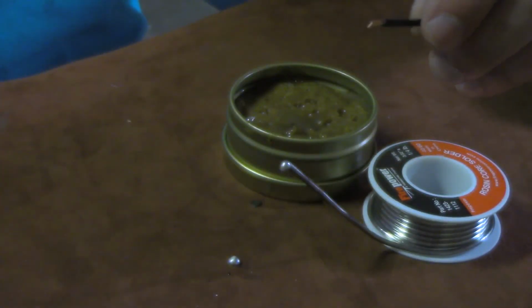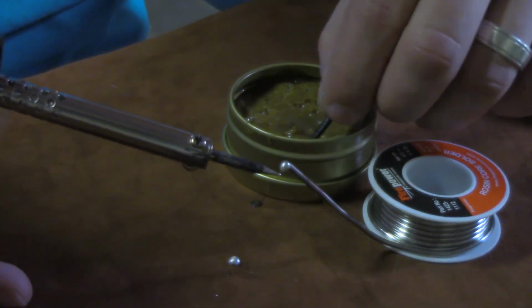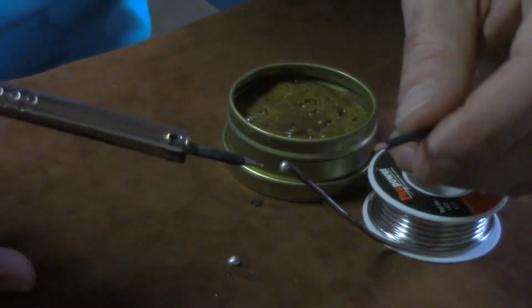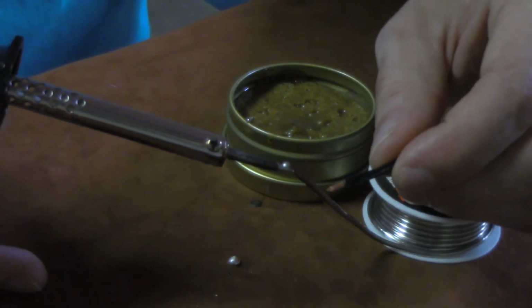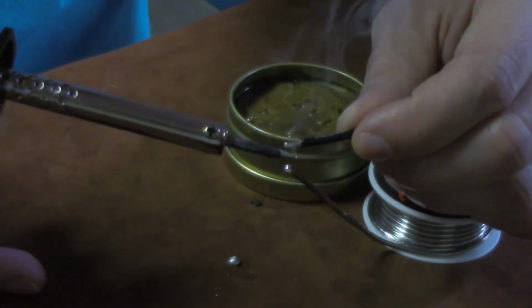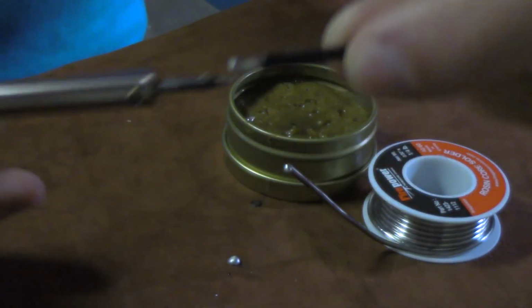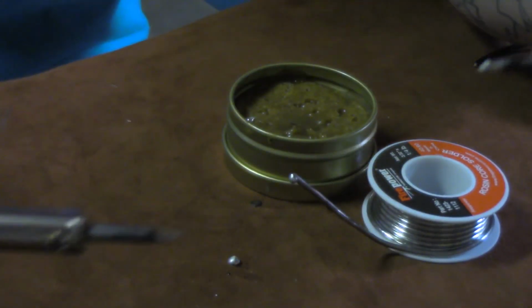The old solder has been sitting on the tip. I always like to clean it off, because when you use old solder that's been sitting there exposed to air for a while, anything hot like that is going to oxidize, just like rust, but it gets oxidation in it. And when you go to solder, you don't get the cleanest looking solder. So here we go. Let's do this one. There's a nice little clean solder joint, really nice. And like I say, every time I'm just going to wipe this off. Listen, we're not making 300 solder connections in this box, so take your time.